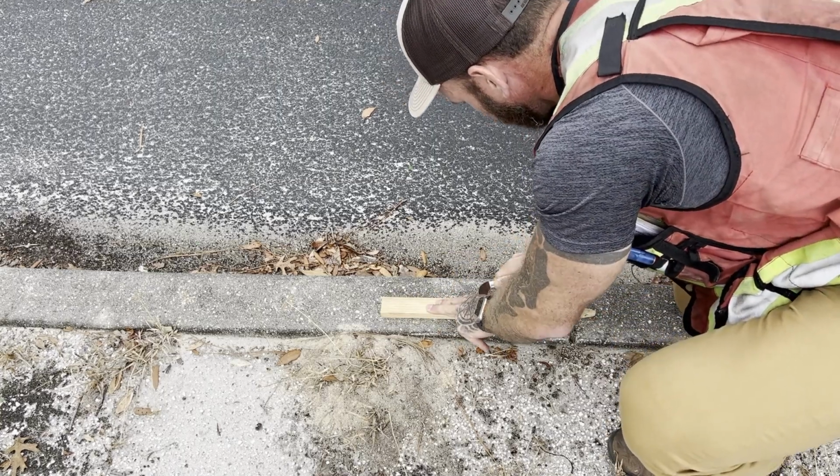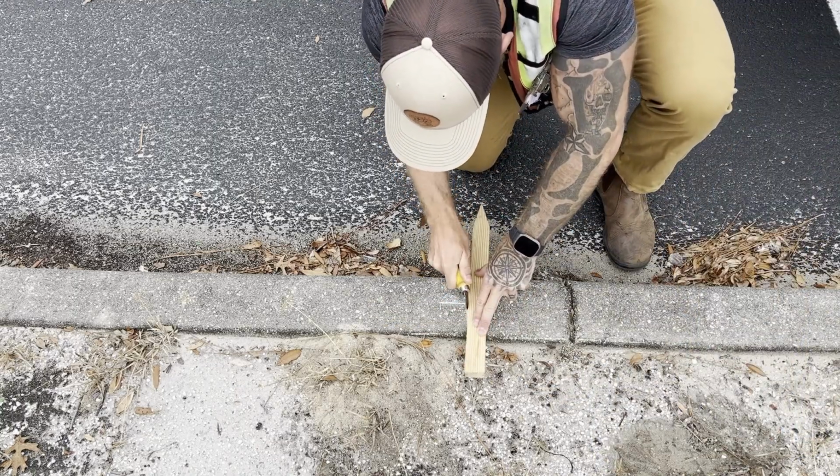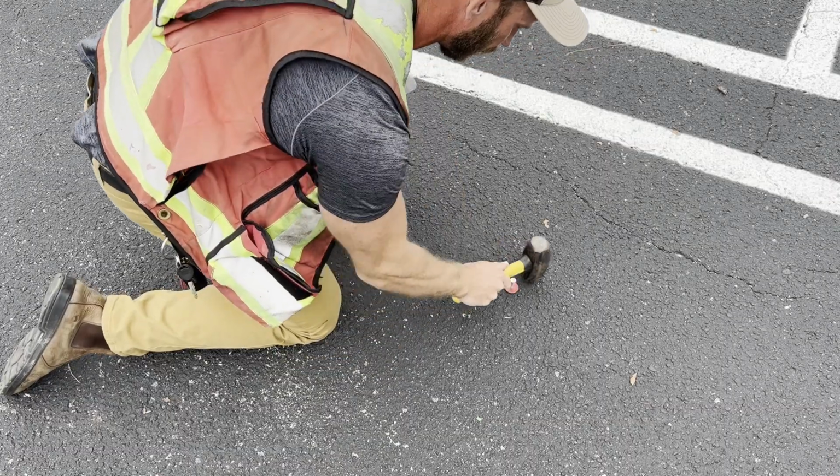After I do my first lap of the site, I start my second lap where I start demarcating my traverse hubs. I usually prefer scribe crosses in concrete, but if I'm in a location where it's not too hot, mag nails on asphalt work great as well.